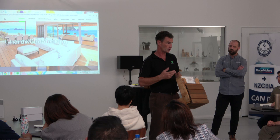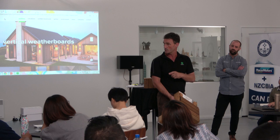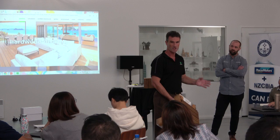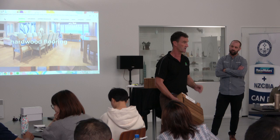If you are doing roof clads, or you've got brickwork or steelwork or things like that, we have some other battens that you can use, which are 40 or 45 mil battens, and they can be used structurally. I can talk to you about those ones, there's a bit more technical stuff on those. But you can save yourself anywhere up to 2 weeks on a job by using structural battens over thinner 20mm battens. So time is money, so you can save yourself quite a bit of time on a project. It's well worth having a look at. It's a really, really good option.